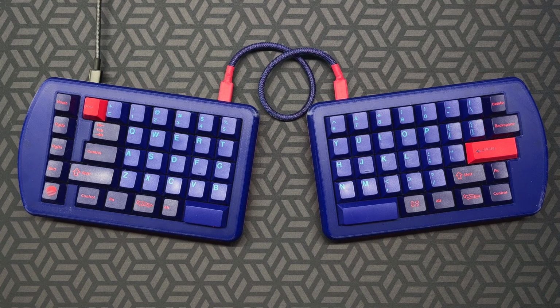If you build this keyboard, note that it only comes with top and bottom plates. Keebio does have case files on their GitHub, but you will need to either 3D print them yourself or find someone to print them for you. I recommend that you print the middle layer in a translucent material to allow the underglow LEDs to shine through. One build note is that Durock V2 stabilizers are a tight fit. They do fit without modification, but it's just something to be aware of.